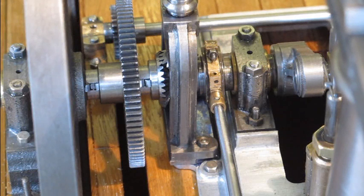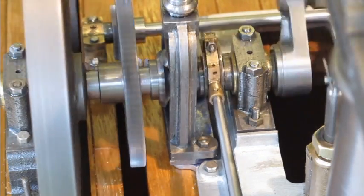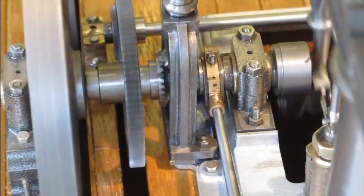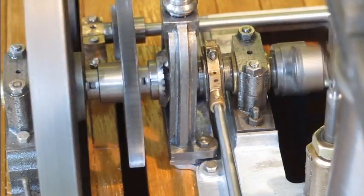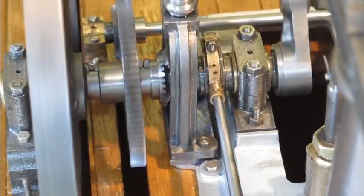Moving around and looking at some of the other components — what you're looking at here is mostly the gear mechanism which drives the shaft for a take-off pulley, and also the eccentric. The eccentric is this brass thing here. Once we start operating the engine, the eccentric moves in an eccentric circle, and the action of that is to move this rod back and forth. That rod operating back and forth links to a cross shaft which then operates the valve mechanism.